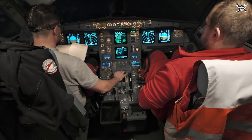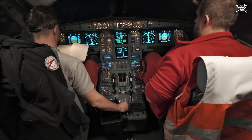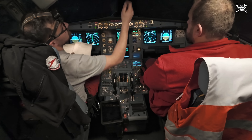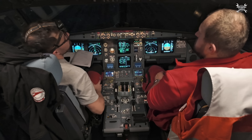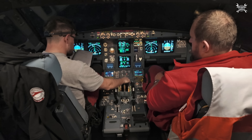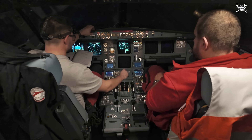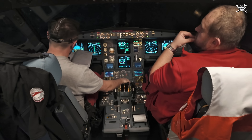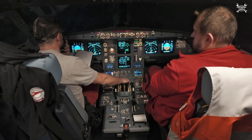After 10 minutes, back to idle. Five minutes at idle, then parking brake set, brake release. Anti-ice system off, cross bleed valve to auto, packs one and two on. After 10 minutes of monitoring we found no odor, which means we can switch to APU bleed, and after the cooldown procedure we can switch off the engines. Fuel flow zero, engine two shutdown, fuel flow zero. Ground, this is Lima Bravo — reporting end of the run-up, we can go back.